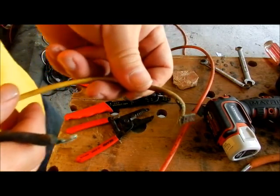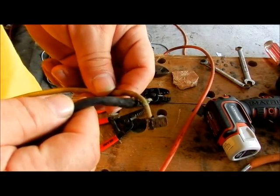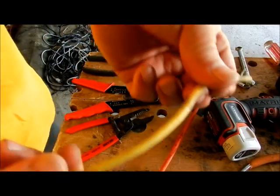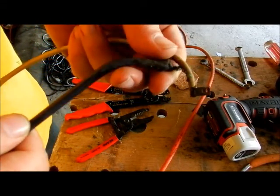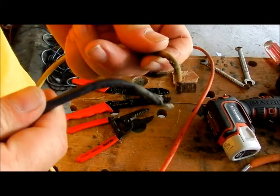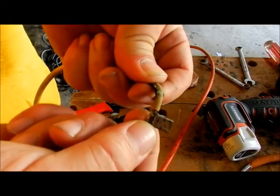So it probably did destroy the capacitor too, and by chance we changed out the capacitor. It's got a new one in there, so that alleviates the problem there, because this yellow goes to Herm on the capacitor. Power was coming straight in from the circuit breaker and fuses on the black wire, and it shorted out right there. And this is very flimsy too.